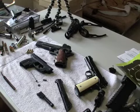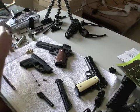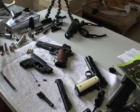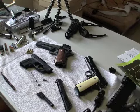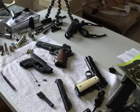When I first received the ammunition, as I said in a previous video, I could tell that they were remanufactured before I even saw the box. And then I started taking some initial measurements, specifically in the caseweb area, because this is where Chuck was having some issues with extraction.